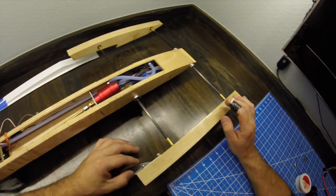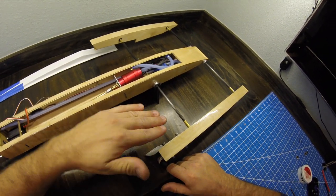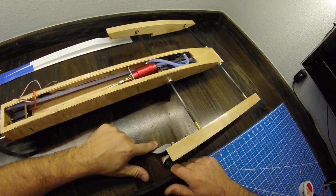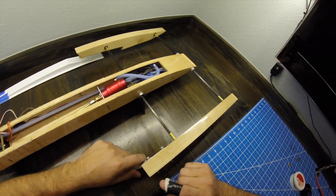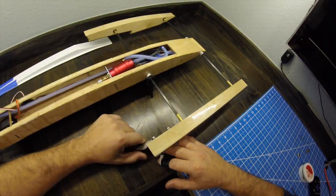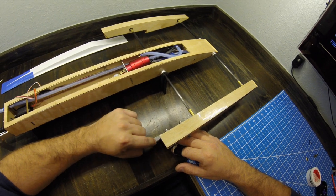So it's always a game once you get it running, trying to tune the boat as best as possible. So your fin, if your fin needs to go up, angle up so it's loose, or down tightens it. The back, I mean. So moving the back forward loosens the boat. Moving this backwards tightens the boat. So it's always a game, so make sure you're not having too much drag. This one comes sharpened on the 33FEs. They don't come sharpened, so you've got to sharpen your own. So if you're really pulling, try sharpening the turn fin a little bit more.